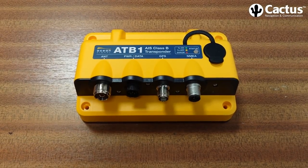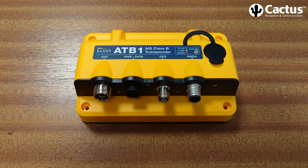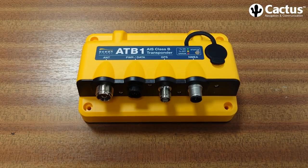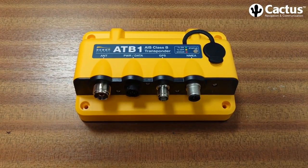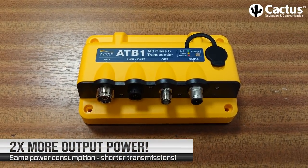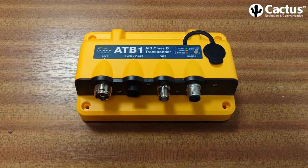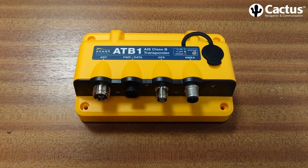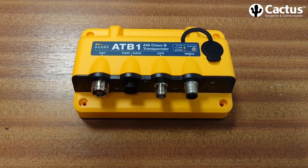The advanced update time that the Class B Plus transponder features is particularly important for powerboats. B Plus also has an important feature attractive to all leisure boat users: the Class B Plus transponders have a much higher power transmission — 5 watts instead of 2 watts. This not only increases the range over which the vessel's transmission will be received, assuming a good antenna installation at a reasonable height, but it will also significantly improve AIS satellite reception, enabling global tracking in a distress situation.